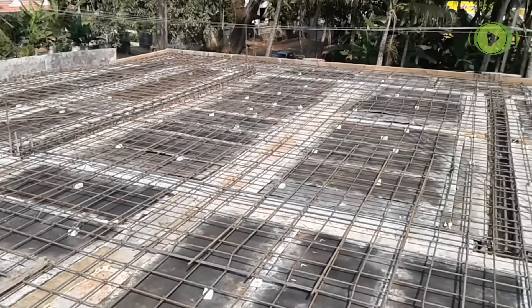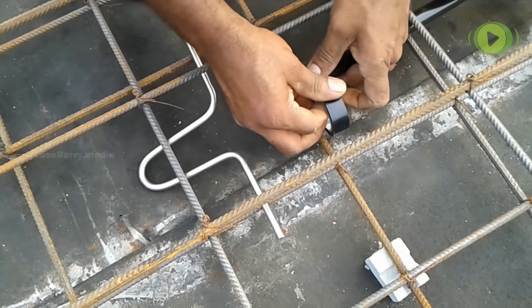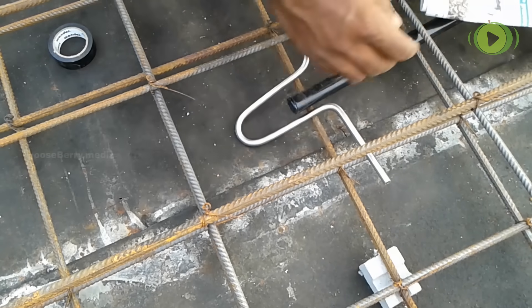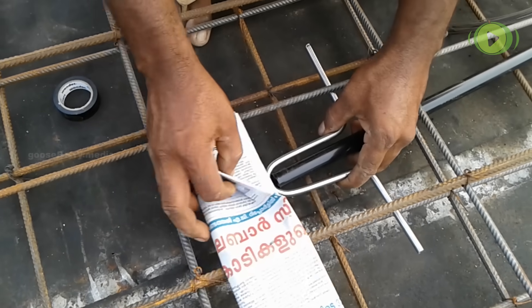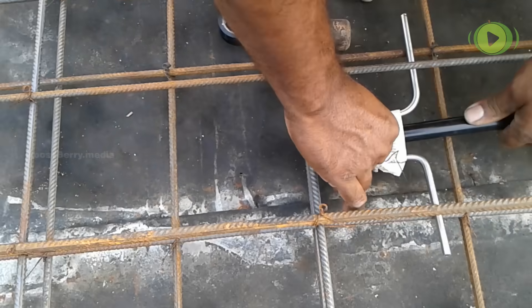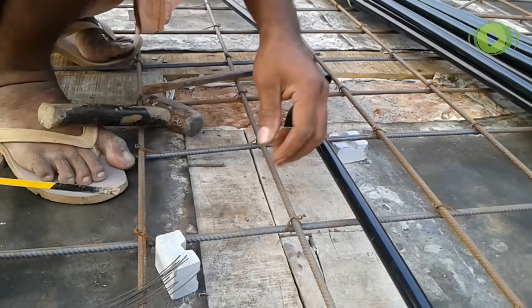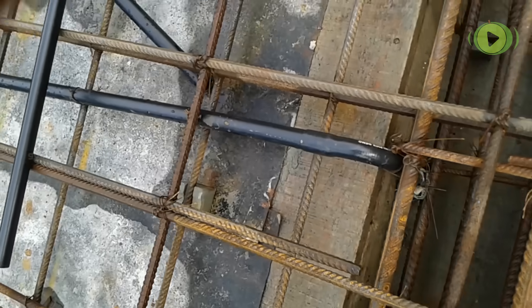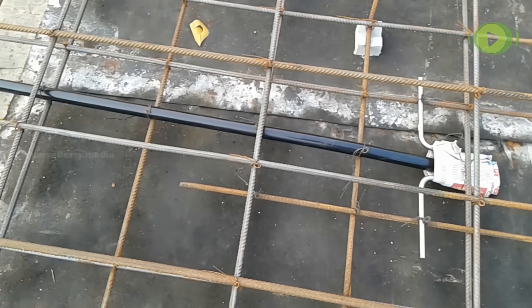After finishing the steel framework, it should be checked by a professional engineer. 20 mm pipes are usually laid through the roof for the passage of electrical wires to ensure aesthetics. Fan points are marked in the shutter using the plan, and hooks of the fan are laid along with the pipes, covered with paper for easy removal after de-shuttering. Both openings of pipes are covered with insulation tape to prevent entry of concrete. The other end of the pipe is given to the nearby wall. Other electrical works are done later. Some hooks are laid in parapets and rooms for cradles, and LED boxes if needed are also laid. All hooks and pipes are tightened to the steel with binding wires.